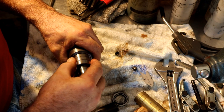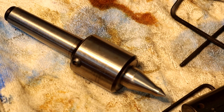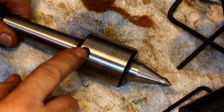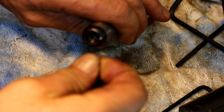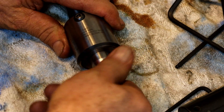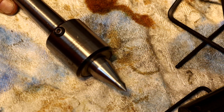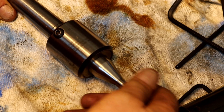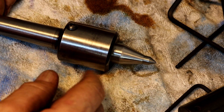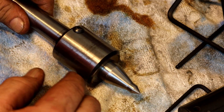Now that goes right back in here — this is a very, very close fit. There we go, all together. Oil fill plug in place, plug in the end with new Teflon tape on there. You need to put it in good and tight and seal it because the oil will come out of here. The seal in the front ring is in place, feels good, and the tip looks great. We'll put her in the lathe and give her a go, see how she performs. Thanks, guys — hope you enjoyed that. Please subscribe, comment, share all that good stuff, and thank you for watching.